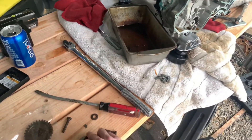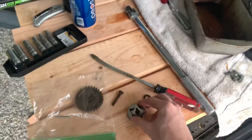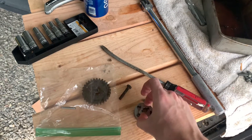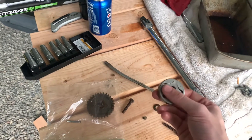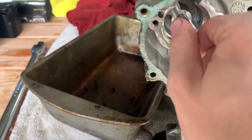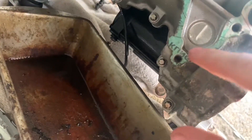The shredded gear was destroyed. The oil pump actually looks pretty good. The manual has an inspection procedure with feeler gauges which I will do, but it doesn't have any signs of damage. The only thing I think that made the oil pump lock up is it spins on this shaft right here in this housing and sucks in oil from the pan at the bottom.